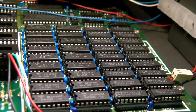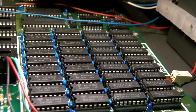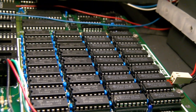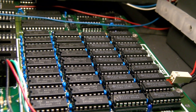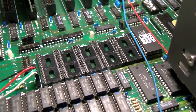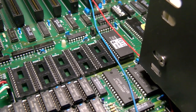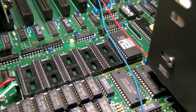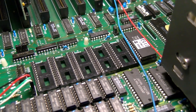So, anyways, we have 640k of RAM, which is actually quite a lot for an XT system, as they're often sold with considerably less than this. I mean, the board can actually be set to run on only 64k. I'm not really sure what that's useful for, because maybe you could run ROM BASIC in that. To which end, you will notice that there is this row of unpopulated ROM sockets, and that's where ROM BASIC would go. Could probably run ROM DOS. I haven't been able to find that. I'd like to give it a go if anyone knows where I can find some bin files for that, or a tool to make a build of it somehow.